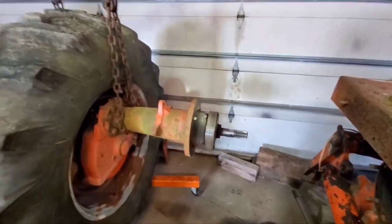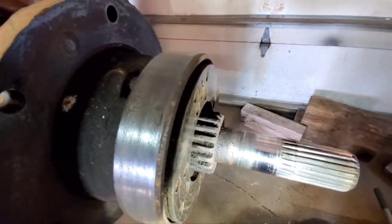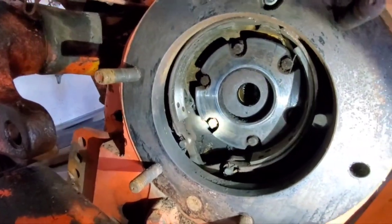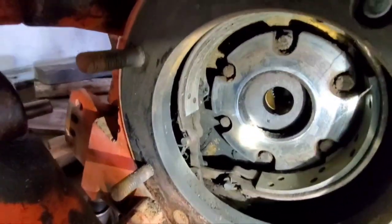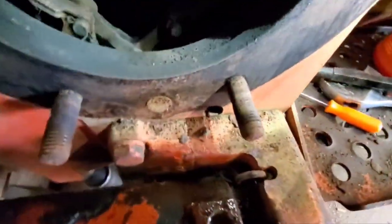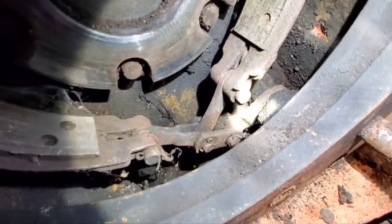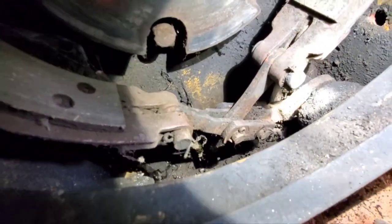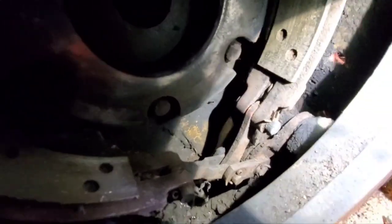So there we go. The pads now, they look pretty darn good in here. Same on the inside. Everything looks good there. There's no oil leaking out of it. The thickness on them pads, no cracks. Problem is, I can't get the camera in here. Not like that. Down in there, that linkage right in there is not moving. Well, it's not moving correctly. And then down where you can't see it is where that rod comes in, the adjuster rod link. I gotta get that moving too.